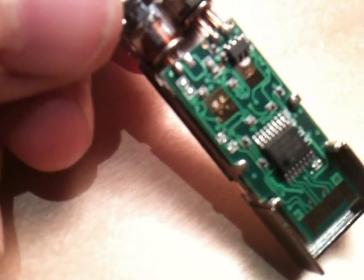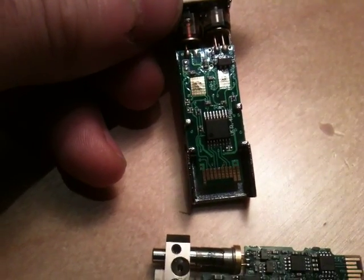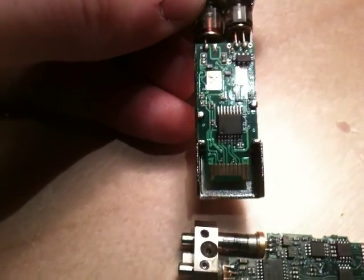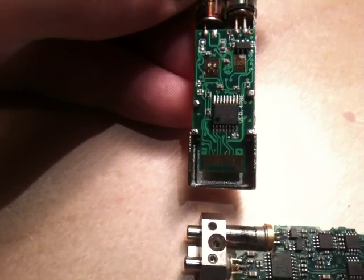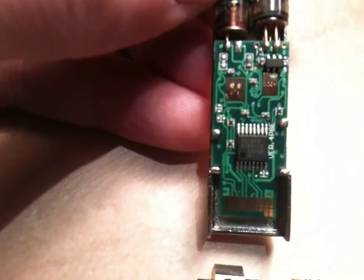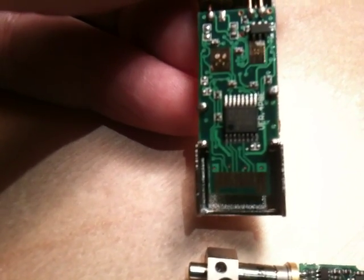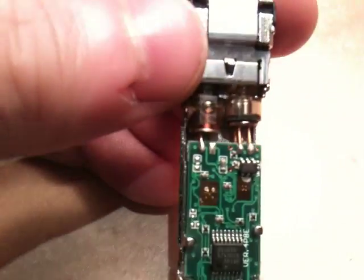Let's take a little look at the difference in construction. The chip on the top is the DS1859 - this is a Maxim chip, and it's actually a dual programmable resistor. It acts as two variable resistors which are controllable under electronic control. The microprocessor can dial in a resistance, and the 4 gigahertz analogue signal will act as if the chip is a resistor. Presumably it's used for temperature control on the laser, because this chip has a built-in memory and a built-in thermistor, and it will automatically adjust the resistances according to the chip's temperature, stabilising the laser and the photodiode.